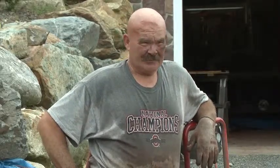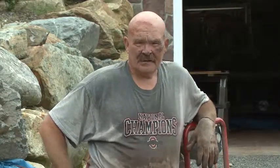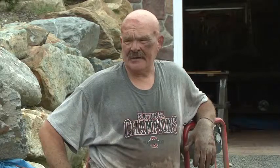Dirty, hard work, you're right. Is it worth it? I think so. I've calculated it, and probably the total cost per block after the concrete, the additives, the molds, and the dye, is probably around 65 to 70 cents per square foot. You compare that to the at least $3 per square foot that you'd pay to buy these, it's quite a bit of savings.